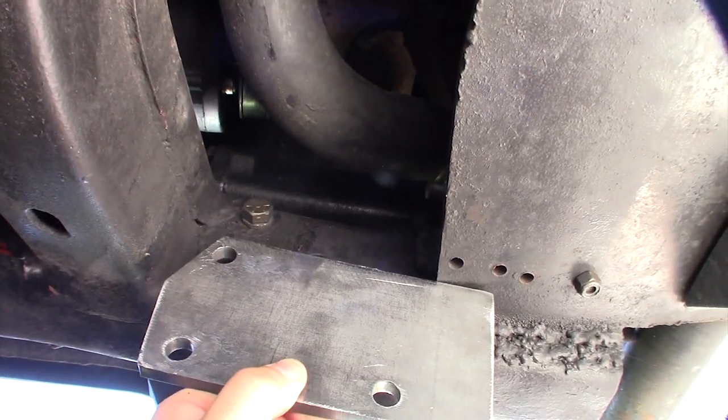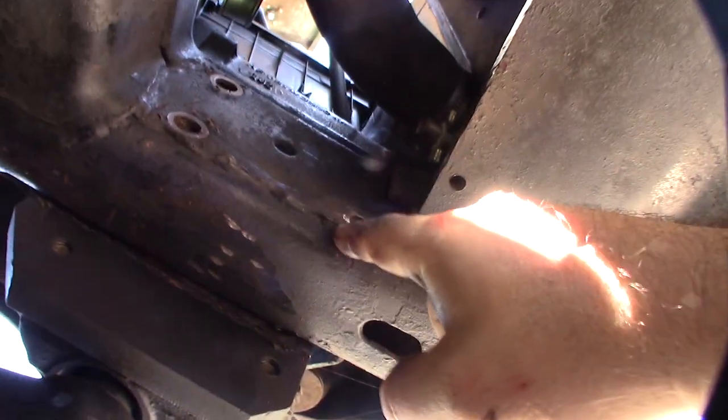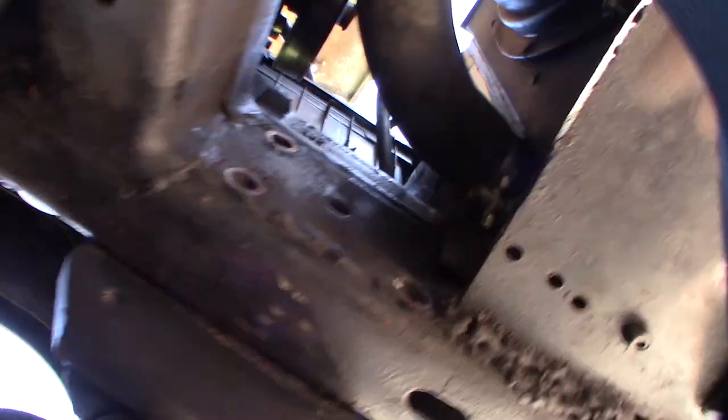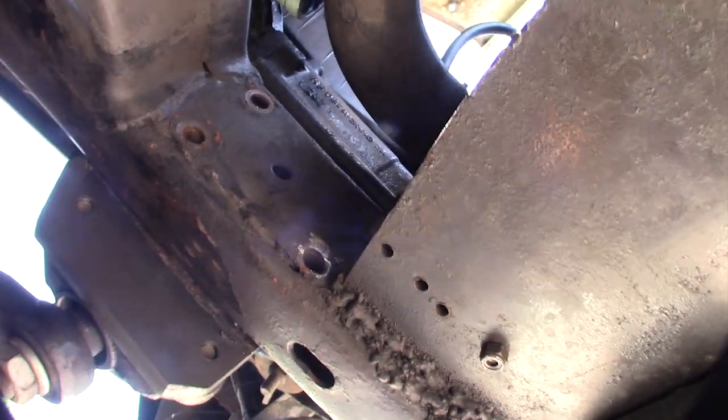It's gonna take a little cut because it's such thick steel. It just adds reinforcement to this plate. I got the bolts off, so I'm gonna go back and clean all these welds - make it flat - then I'll go back and weld it. I'll use my little grinder.